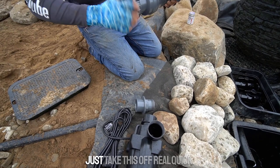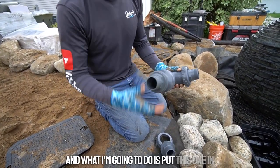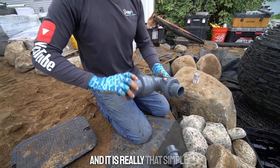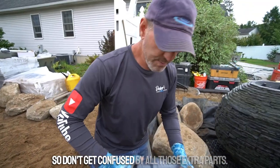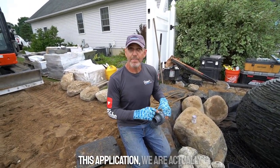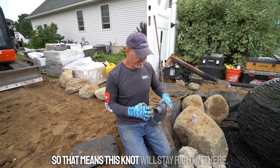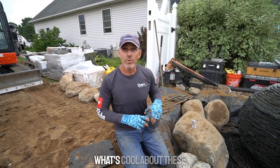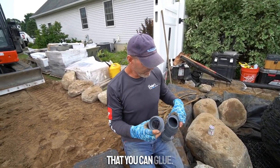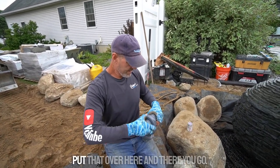So what I'm gonna do is just take this off real quick, and put this one in, put our nut back, and it is really that simple. So don't get confused by all those extra parts. The other thing is right here, in this application, we are actually gonna glue our pipe on in there. So that means this nut will stay right in there. What's cool about these is, on the other side, is a slip fitting that you can glue. So what I'm gonna do is put that this way, put that over here,